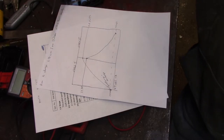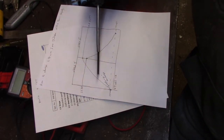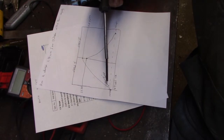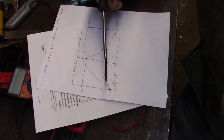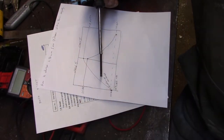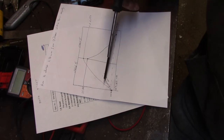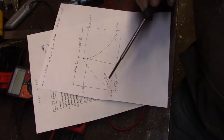This is how a lithium-ion battery charges. The lowest voltage the battery pack recognizes as a discharged battery, when we're talking one cell here, is 3 volts. The maximum current we can put into these Samsung batteries, per the spec data sheet, is 125 milliamps. Your lower voltage that you'll read on one cell will be 3 volts, plus or minus, discharged.